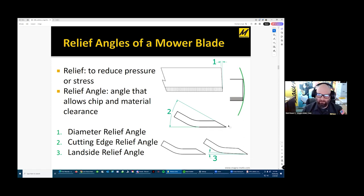The cutting edge angle is the one everybody notices — typically 30 degrees for finish mowers, with some at 35 degrees. Usually 40 and 45 degrees are reserved for brush cutting or rough cutting mowers. This angle is a lot like the helical space in a drill where the chip leaves. When grass gets cut, it flows over the cutting edge up to the lift, and the lift with the air turbulence it creates discharges the cut grass. So this angle is for chip relief.